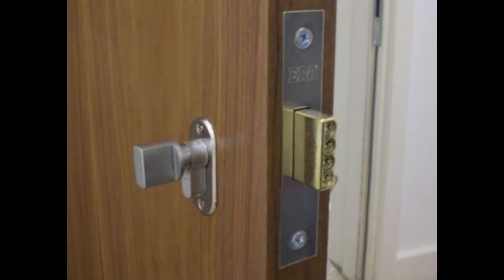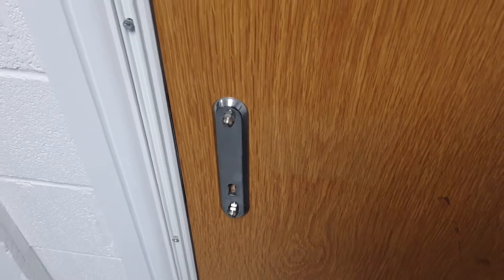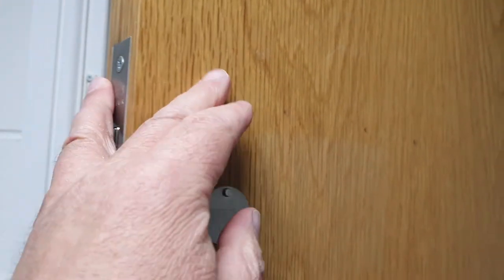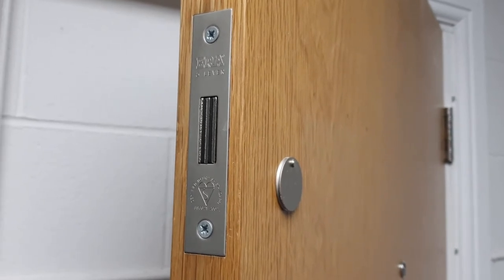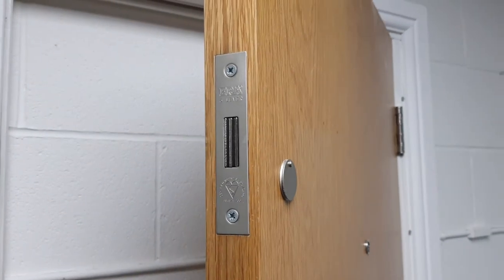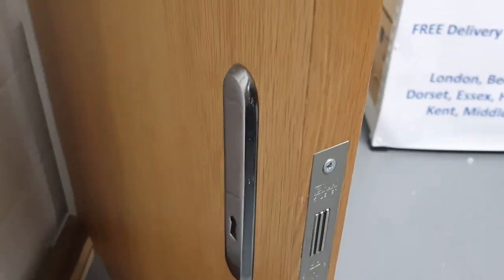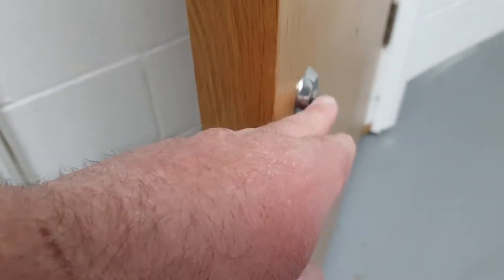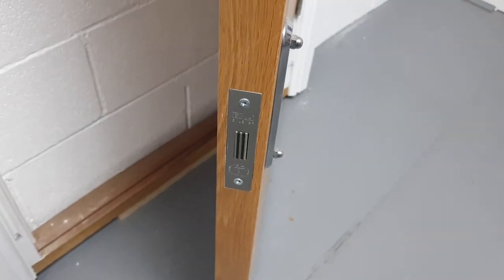The second way to mitigate the door splitting is with deadlock reinforcers. When you fit a mortise lock you cut a large square hole in the door, leaving thin pieces of timber on either side — weakening the door and making it easier to split. Deadlock reinforcers address this: on the outside there are no exposed bolt holes so the device can't be dismantled, and on the inside threaded rods are tightened with a spanner, compressing the timber and preventing it from splitting out, making the whole assembly much stronger.